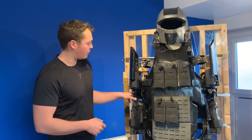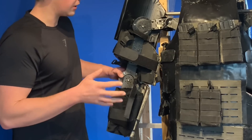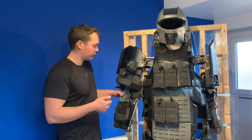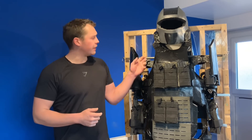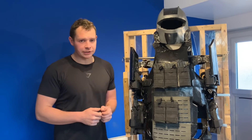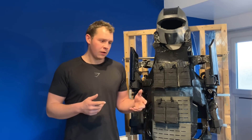If I rotate the armor open, you can see it is made with a carbon fiber internal exoskeleton structure, with some aluminium still in place to help form the shape, and basic neoprene padding for comfort. The armor itself is a multi-layered carbon ceramic kevlar composite. Testing has been limited as a civilian in the UK, but I have been able to test the armor and it will stop 5.56 out of a 22-inch barrel bolt action with standard ball ammunition at 25 yards. In a rifle firing position, a military soldier would have around 95% coverage of their full body protected.